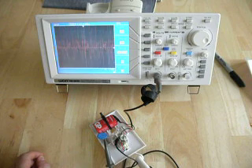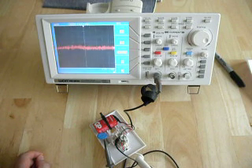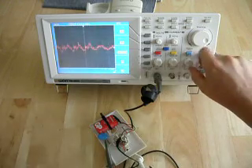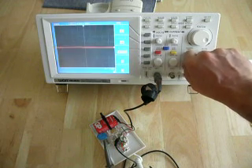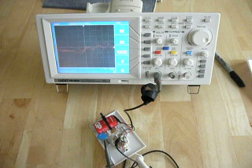That's all there is to getting one of these telephone handsets to work with an oscilloscope. You can actually do things like whistle into it and get pure sine waves. If we go to a higher time base — we're currently on 5 milliseconds right now — if we go down to 250 microseconds and do that whistle again, we should be able to see the sound wave.